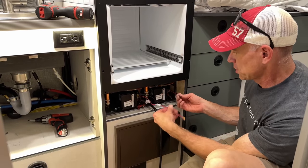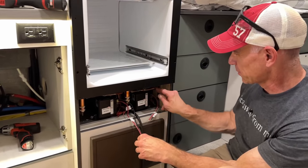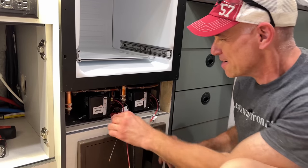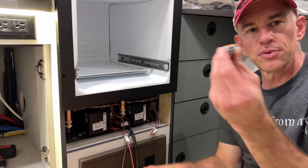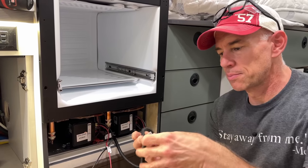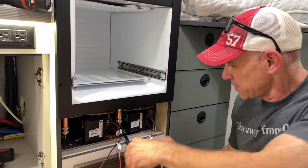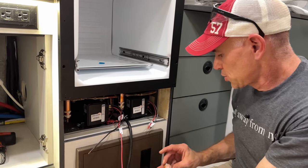All right, so I've got actually 2 sets of wire. One for the fridge, we figured out, is on the left, and the freezer is on the right. And make sure these connections are all still in. They didn't get messed up while I was brutalizing the fridge for 14 attempts at putting it in. Anyway. So the easiest way for me to connect that up is going to be with these little Wago connectors, because I've got one connection in, so I'll just put all 3 of the reds, all 3 of the blacks, or red, red, yellow, and black, black, white. We'll wire it up that way, and then put in a fuse. Brought a fuse. It'll be there. And then it should light up.